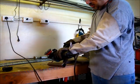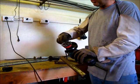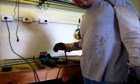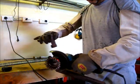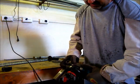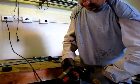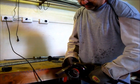Now for that part, you can use this with a wire brush, like a wire wheel like this, or with a grinding wheel. Just cut this off for a second. Okay, so if you're using the wire wheel, this goes on like so. It's got two holes. You put in the closer hole, so this comes closer to the wheel. This is where you rest your material, where you're grinding or where you're wire brushing. This is where it goes, as you can see by these marks. And if you're using the grinding wheel, you just move it one hole out to give it some distance.